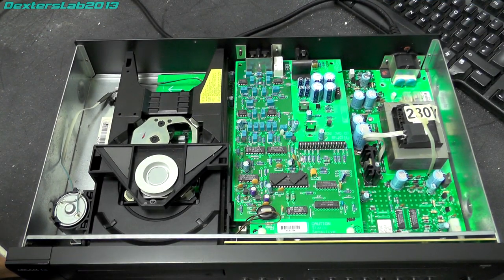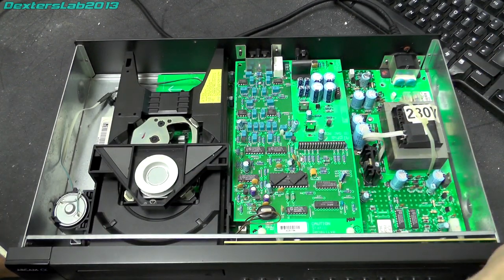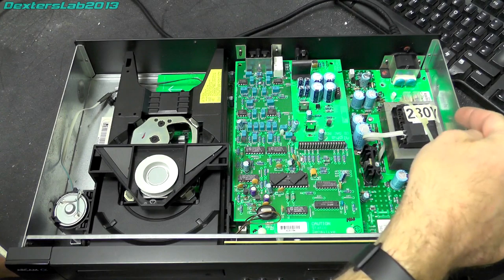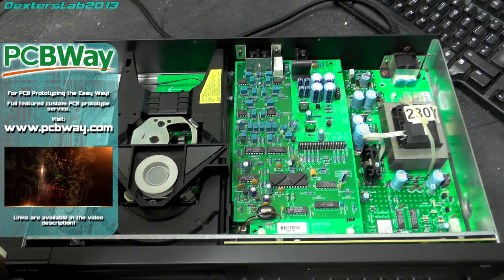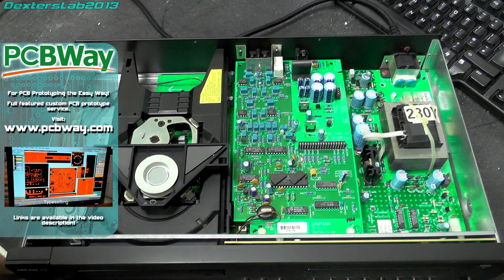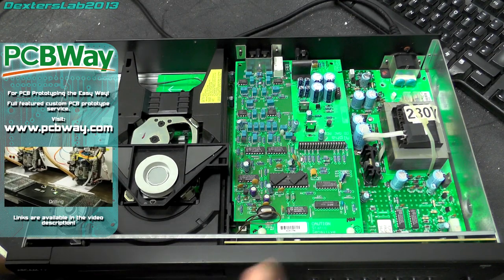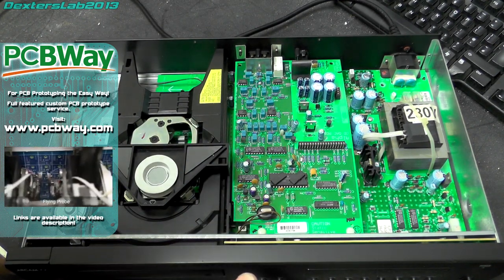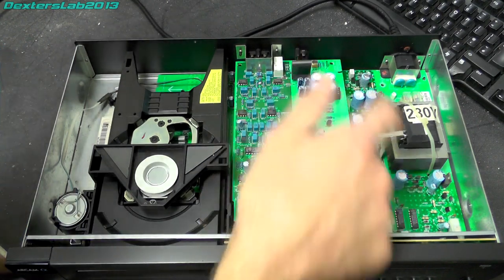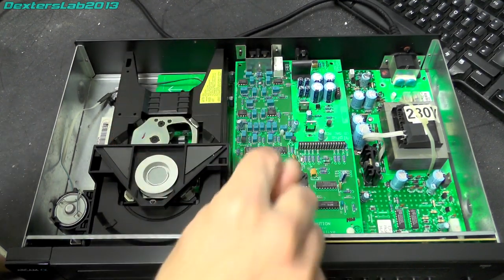Let's just quickly run over what components we have in here. So there's a PCB on the base — looks like the main control unit — and we've also got a power supply with an old-style linear transformer. Obviously 230 volts, so it's fixed for 230; whether there are jumpers to change that I don't know. We've got quite a lot of electrolytic capacitors and given that they're getting on a bit they could probably do with changing, but none of them are swollen so they're probably best left as they are until something goes bad. On the top here we've got a DAC PCB doing the digital-to-analog conversion and out to the back, and there's probably more control logic underneath that.